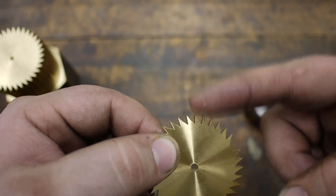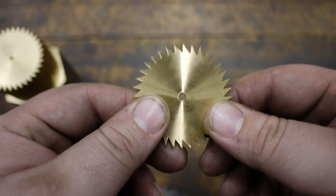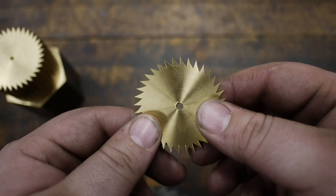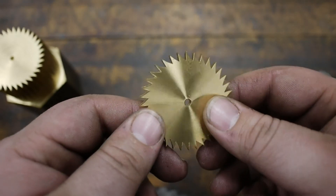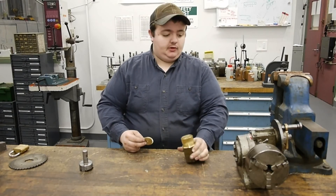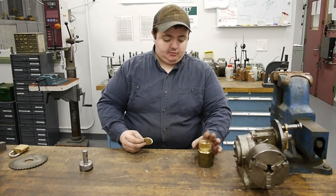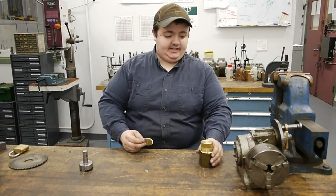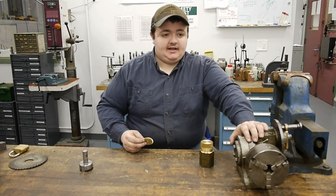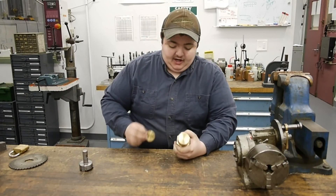There's a pallet fork that rides along the top and engages each tooth, similar to an antique or clock mechanism. In olden days these were hand filed — having modern machinery now, a bench grinder, a little surface grinder, and a piece of high speed steel, we can automate this and make a part that probably hasn't been made in a school like this in either ever or the last hundred years. We still have enough stock to part off about two more in the future. I've got a bigger indexing head coming — a nice big 10-inch Victoria — with a spiral milling attachment, so we'll be able to do spiral bevel gears in the future.